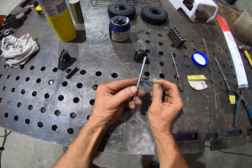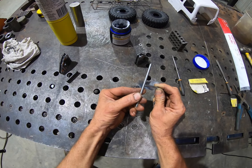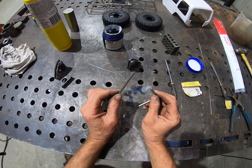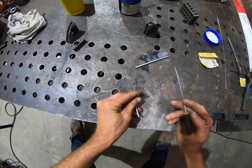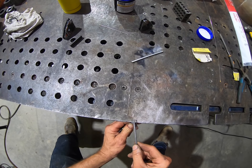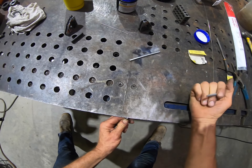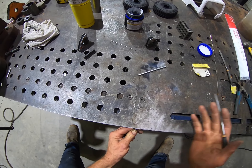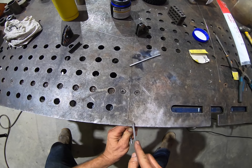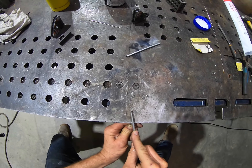You can either fill the gap or you can notch it out, shape it, and really let the brazing work for you. Just because there's a gap and you fill it with braze doesn't necessarily mean it's stronger - it's not. So spend the time, do a notch, shape it, and you'll get a better job. I sometimes use an angle grinder - most of the time actually - just to put a little cut in there. You could also use a Dremel or a little hacksaw. For this purpose I'll just start off with the rat's tail file.